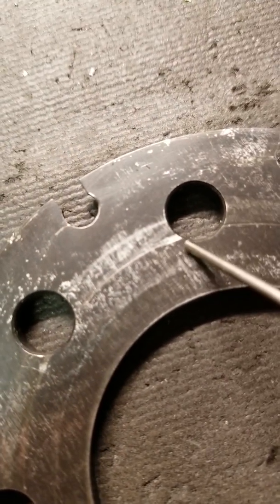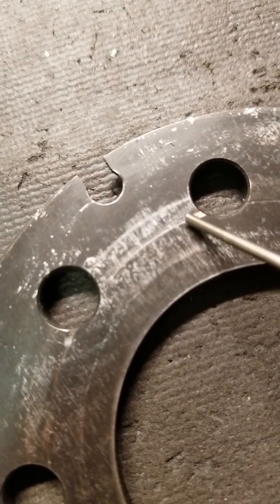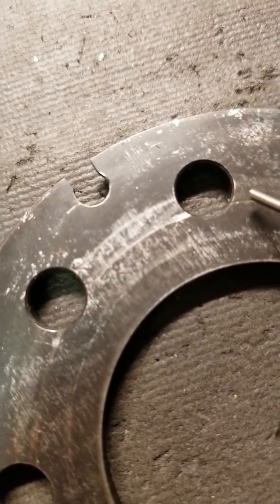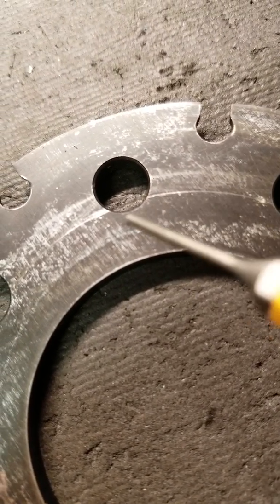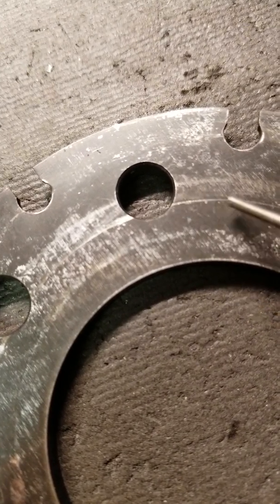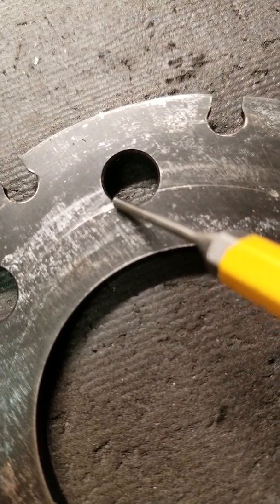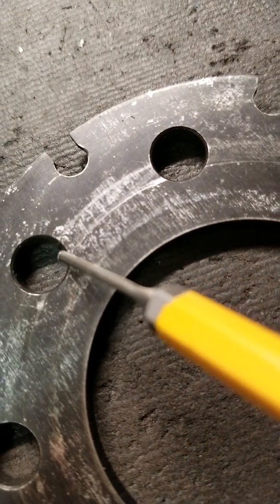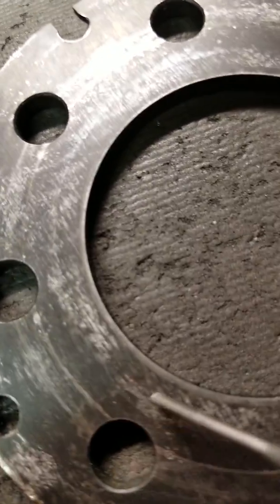Then we get to the next piece. It's hard to see the focus here, but you see this drag and that drag. This is the pawl being set so poorly. Something's wrong with that pawl. I'm trying to figure out how the pawl could do this and not be completely destroyed. You can see it's dragging so hard as to score the metal all the way around to the next spot, and then dragging through again and again.